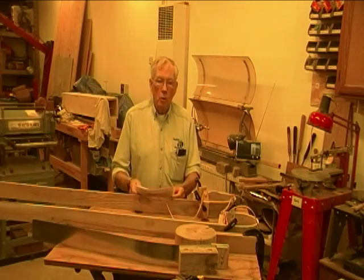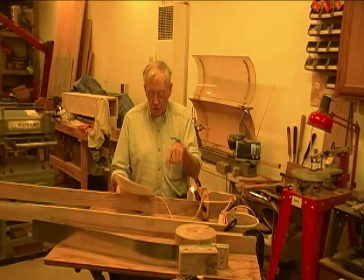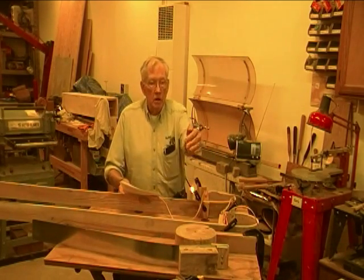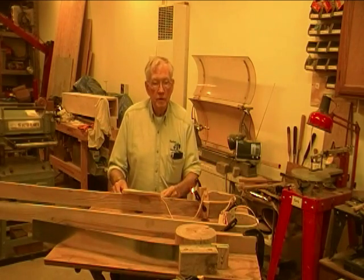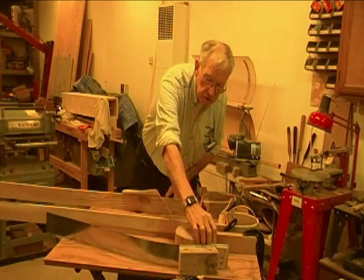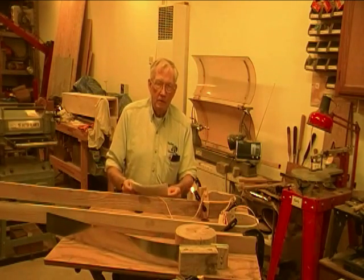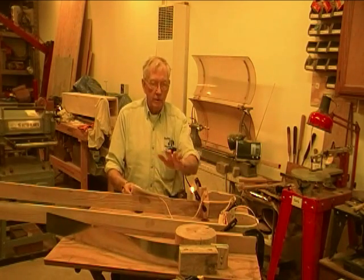My first fixture was simply a 7-inch diameter cylinder of wood that was about 3 inches high. I screwed it to a sacrificial plywood table and then clamped a block of wood about 3/8 of an inch away that would strap the end of the piece while I bent it. And that setup gave me my first 3 failures. I didn't have this metal strap to back things up. I didn't have anything to fix the edge of where I was bending, and a bunch of other problems. So that setup gave me my first 3 failures. So what you see here is totally redesigned.